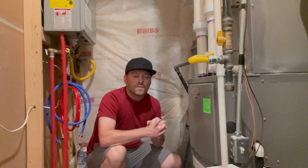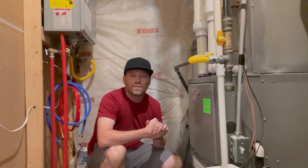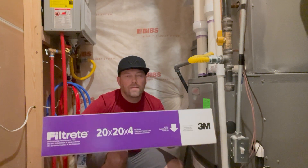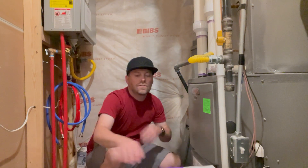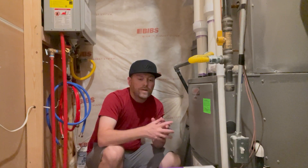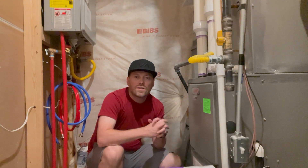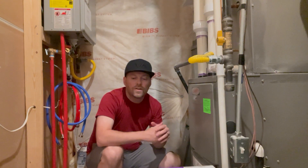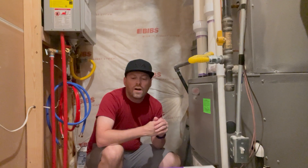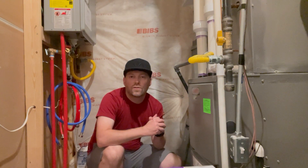A lot of times there's the dilemma — do you do a 4-inch filter, a 1-inch filter, 2-inch filter? And what I'm talking about is the depth of it. My filter does a 20 by 20 and then I get the 4-inch deep filter. The big difference is the 4-inch has a lot more surface area compared to a 1-inch filter, and that allows the filter to have a longer service life since it's not getting clogged up as fast as a 1-inch or 2-inch filter.